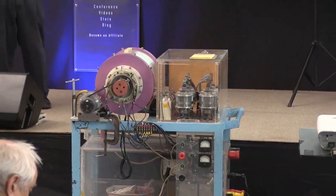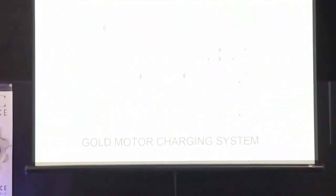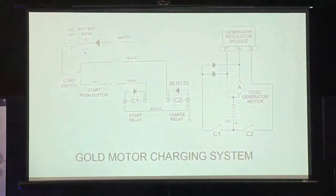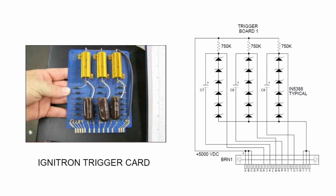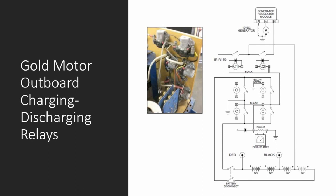Some of the other systems — this was the charging system. This particular technology, for reasons I'll explain later, you can't start the motor from zero speed; you have to speed it up to a minimum of 500 RPM. They were able to use a generator that could also be used as a starter. In one configuration, you'd turn it on as a start motor, get this thing going up to 500 RPM in working mode, then take the energy off the shaft and run a generator to recharge some of the batteries.